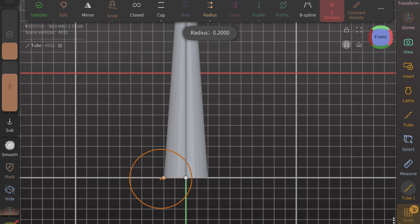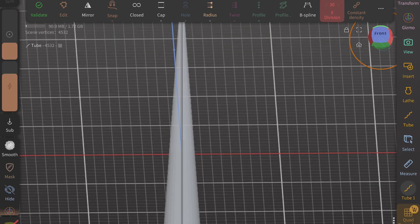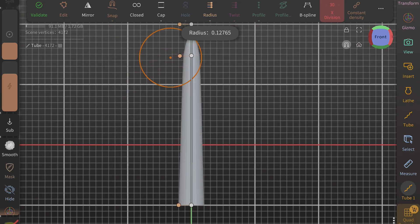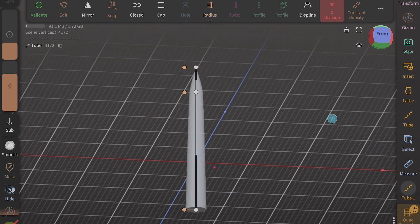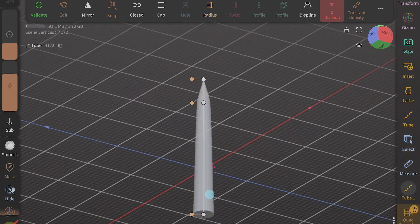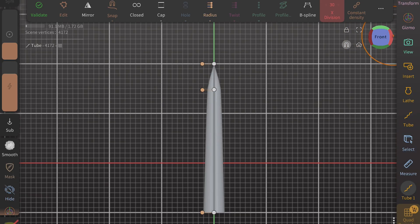Now we're going to take the top of the tube and bring it to a point, and we're going to take the bottom and bring that in also to be the bottom of the blade. If you think about it structurally, we would probably want that to be three, maybe four units wide. Now obviously it looks like a big spike right now. We're going to add another unit — we're going to click on the center line and draw the blade out to the width we want at the upper part of the blade. You can make your blade have different shapes, but right now it's just sort of like a giant spike. So what we're going to need to do now is change the profile of the blade.